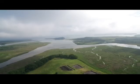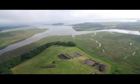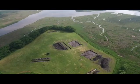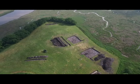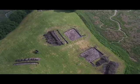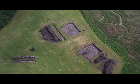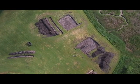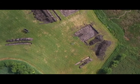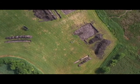More recently, drones have been used quite intensively in surveys like this, using structure from motion, or multi-image photogrammetry. Now, I'm going to do another video on the specifics of that hopefully soon, looking at it from a terrestrial perspective, but the same principles apply. Basically, that involves flying over a site or a feature with a drone, taking numerous photos, and then using specialist software to stitch those into a three-dimensional point cloud, which you can use to construct a topographic model.